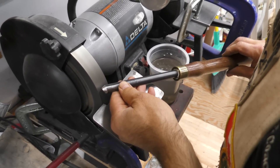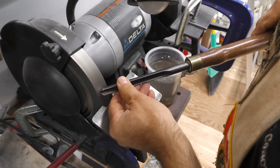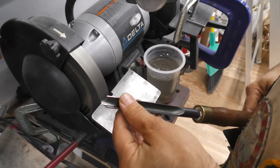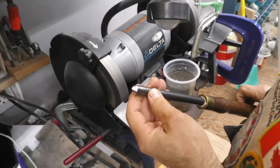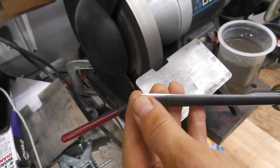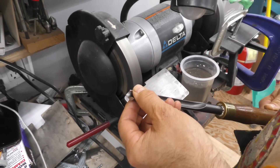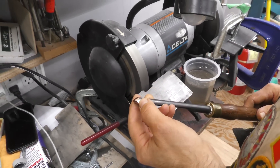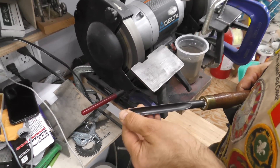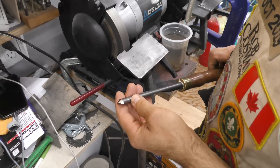Let me pay attention a little closer and try that again. I didn't distort my shape. I can see that I've got a new bevel all the way around. A little something funky going on here, but I don't think it's going to bother me — I went a little bit deep, but that'll still work. There's a bit of a burr on there. You can take it off if you want, but it'll actually come off when we're turning, so not to worry.